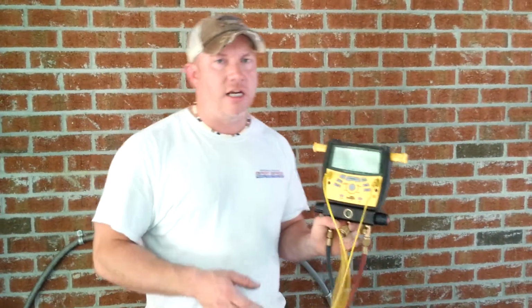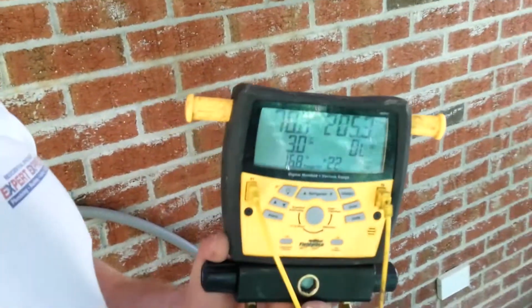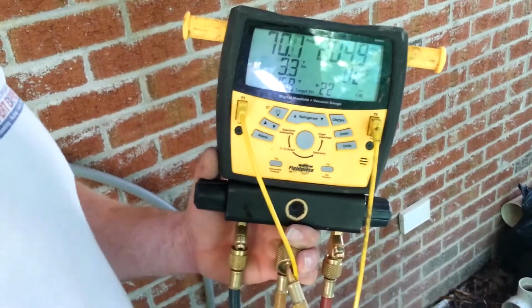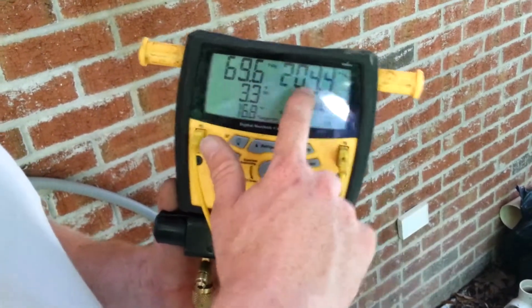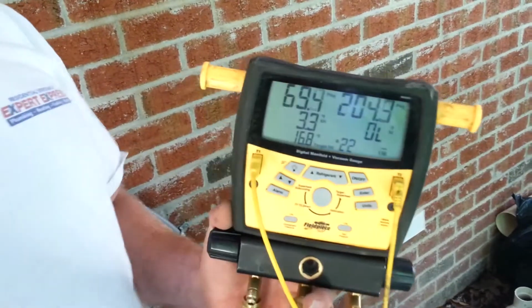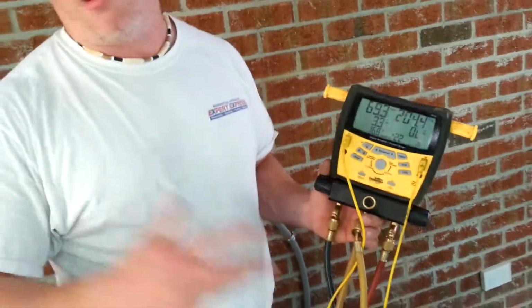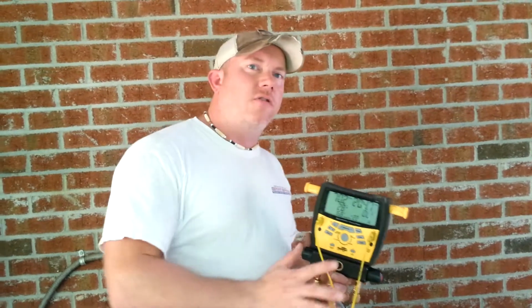Now, if you look at the pressures here, if you were not taking your wet bulb and not using your temperature probes, a lot of the old timers, or rule of thumbers, would say, hey, my suction's 70 and my head pressure is 200. Hey, I'm good, it's perfectly fine. These people just don't know what the heck they're talking about. They'll just tell them, oh, I added some more, or whatever the case may be, charge them some money and go. That's the difference between a great technician and a bad technician, is having all the information.